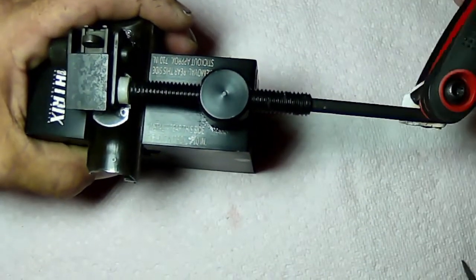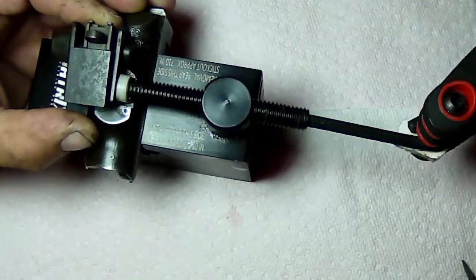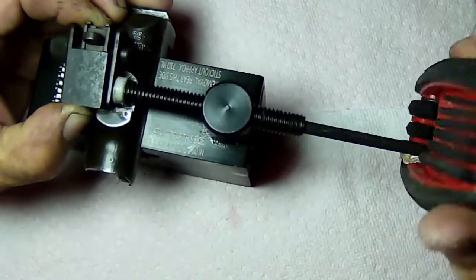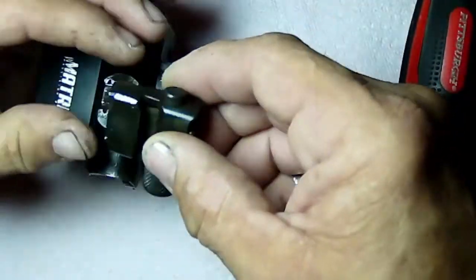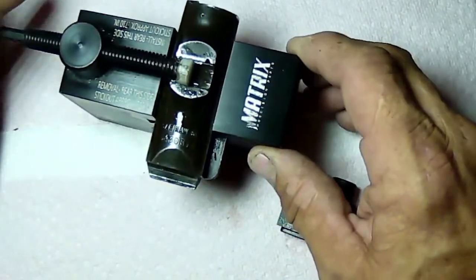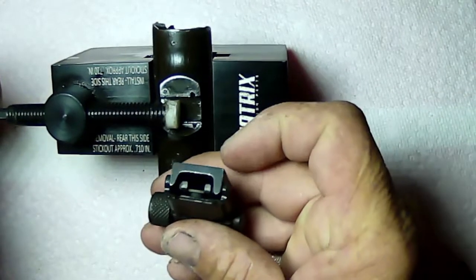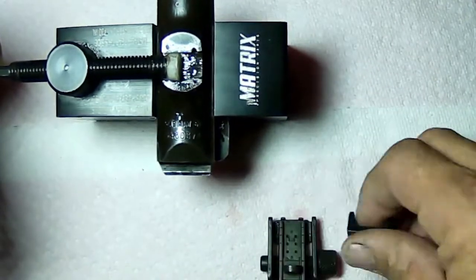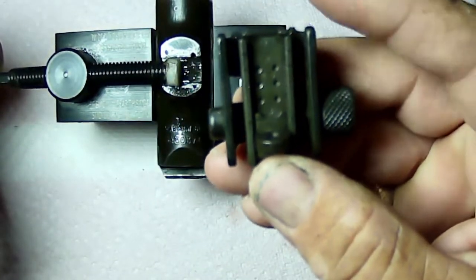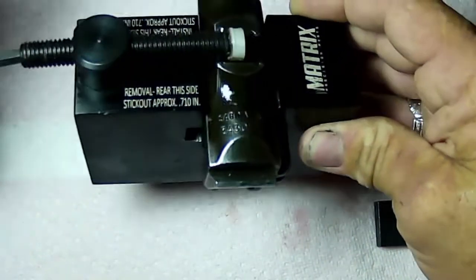And it shall be out. There we are. Okay. No damage to it. That's out. And remember, when we first put it on, we lined up those dovetails, and it lined up the stake marks to the stake mark that's right there. If you can see that, right there. So that's taking it off and putting it on.